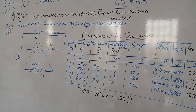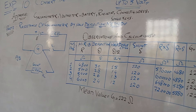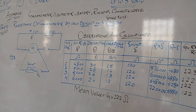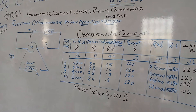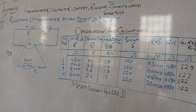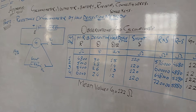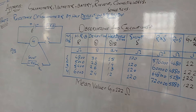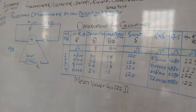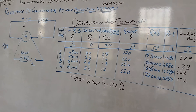There are three parts of this experiment. In the first part, we find the resistance of the galvanometer by the half-deflection method. Students, you are already familiar with this method and the circuit diagram. In this diagram, we have connected battery, high-resistance box E1, and galvanometer in series. Also, we have connected a low resistance called shunt and key2 in parallel to the galvanometer.